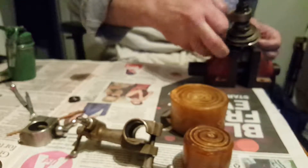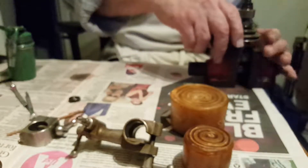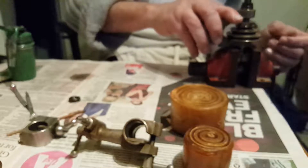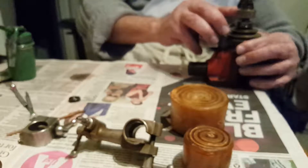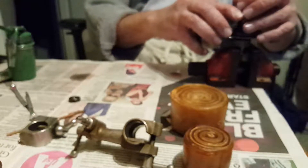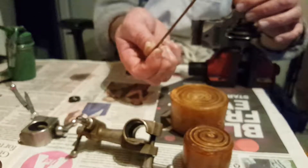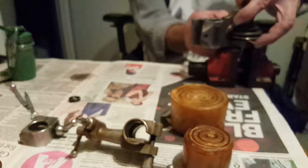It's just a matter of giving the spindle enough room. Make sure it is flat against the vise. Bring up that pulley out of the way, because if you smack it and that pulley ends up hitting down on the frame, it could very well just shatter it. You can put a piece of wood in there between the pulley and the frame to be on the safe side.